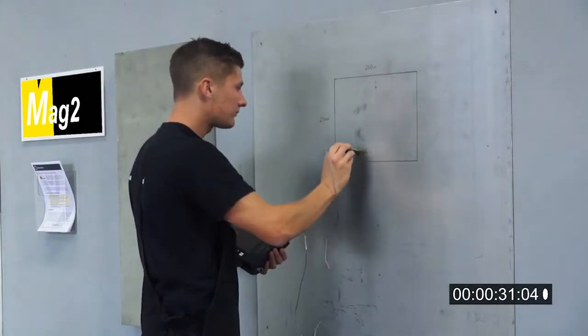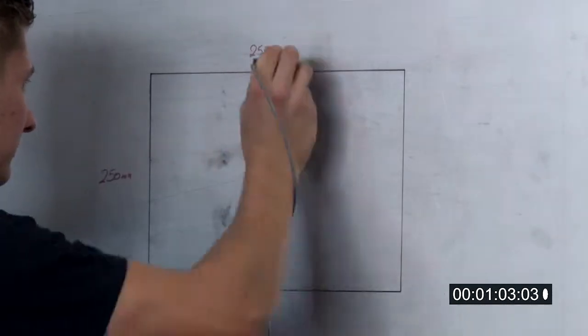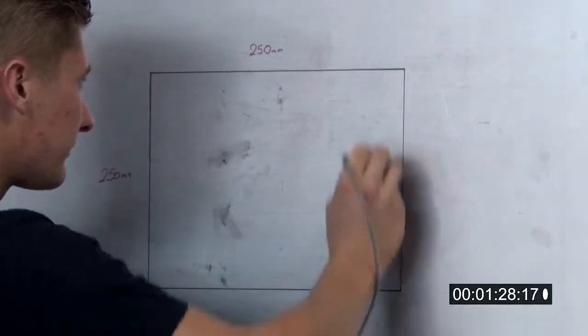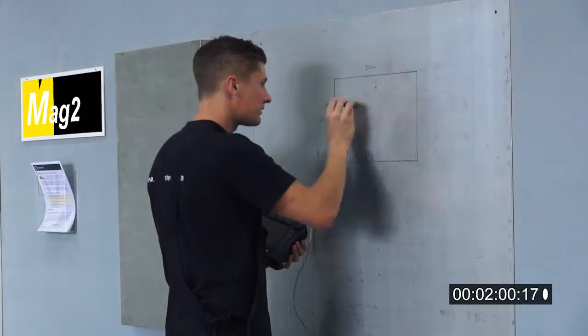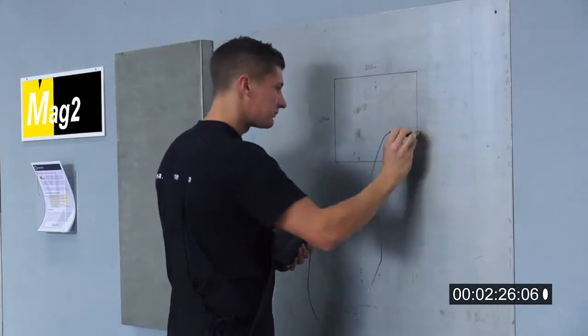In the food industry there are spray dryers and large stainless steel vessels that have in the past been tested with dye penetrants or eddy currents. Eddy currents would take absolutely weeks to carry out a test on a spray dryer, whereas MAG2 can be done in just a few hours. Some companies claim they can test large stainless steel surfaces with eddy currents, but this method is very time consuming, which makes it impossible to scan large vessels. The use of eddy currents inevitably leads to corners being cut and defects being missed.